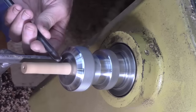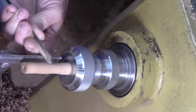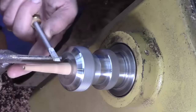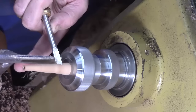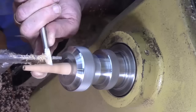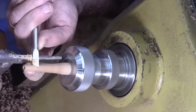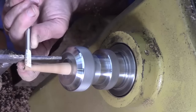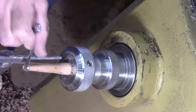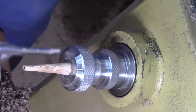Switch into a 3/8-inch spindle gouge. I should be able to get a little finer finish with the skew. I think what I'm going to do is put a coat of sanding sealer on here, dribble some CA glue, and then finish — hoping that'll hold it well enough.